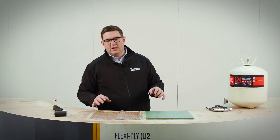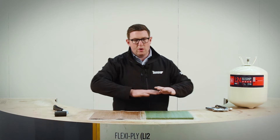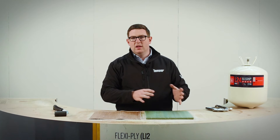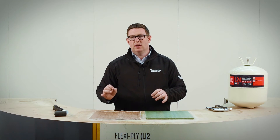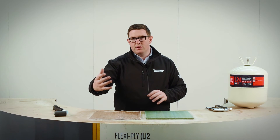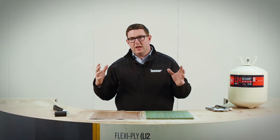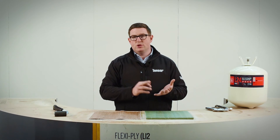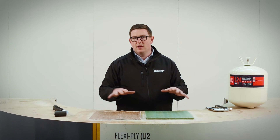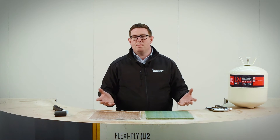The unique thing about this product is that we prime-coated that off and applied the top coat. When we put this together, there is a second stage to bonding in the veneer — that is actually the second stage when you come to doing the actual lacquering process. Maybe a two-part AC lacquer, a urethane lacquer, a water-based lacquer — whatever it is, make sure that it is actually built up.